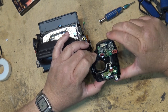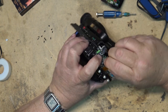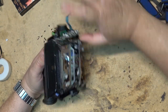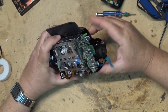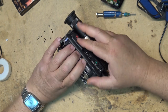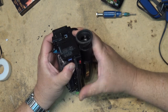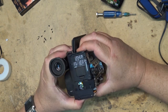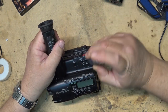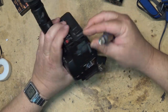Here's going to be the problem: surface-mounted electrolytics. It's going to be full of them and they're going to all be shot, or a lot of them are going to be shot. There are three problems I can see right now with this camera. One: it doesn't play because caps — multiple caps — are going to be bad in the video circuit. Two: the lens does not zoom. Three: the viewfinder does not display a picture, just a vertical line. And I just noticed it also has no sound on playback.